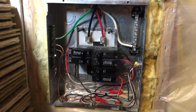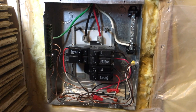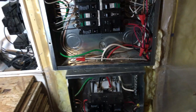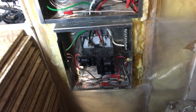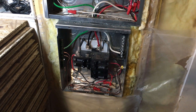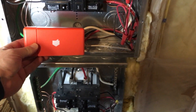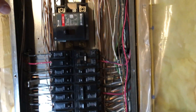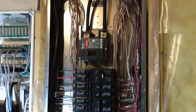This energy monitor does not require a lot of power — it's minimal. I have an extra 30-amp breaker here, which is overkill; you really just need to install the smallest size double-pole breaker available that fits your panel. The monitor is going to go up here, I'll feed things through for power from the sub-panel, and then my CT clips are going to go up on the two main lines that come into the main panel.